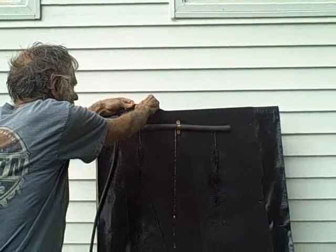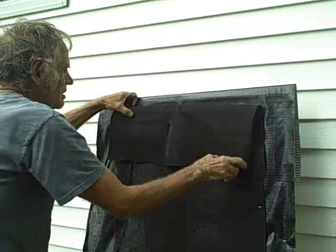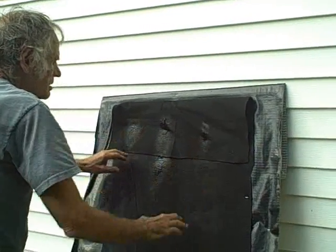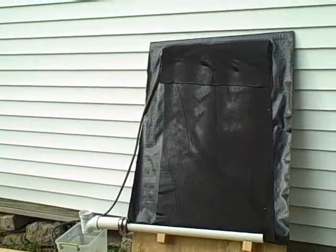There's a chamber called a trickle-down chamber, and if we cover it like this, we can force the water onto the polyester felt and increase the contact. This is the basic idea of the trickle-down collector using the gutter and polyester felt. Thank you for watching NTD Solar 102.